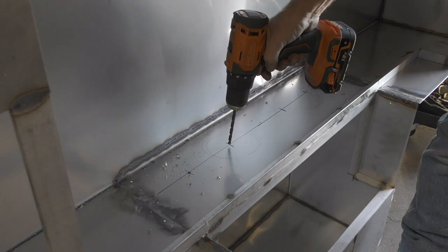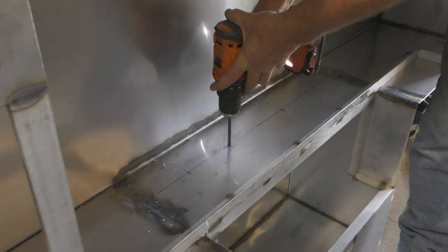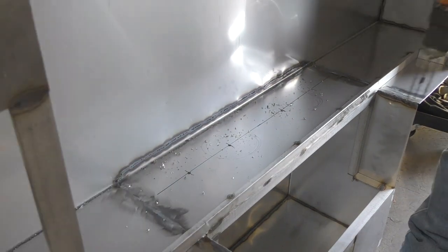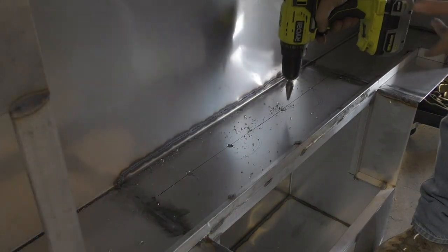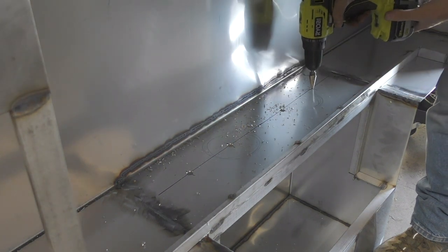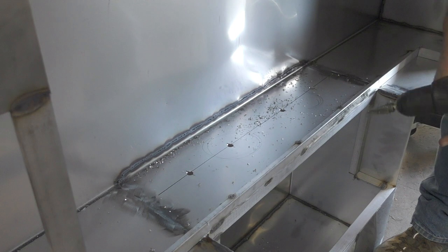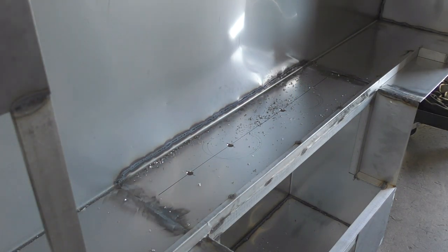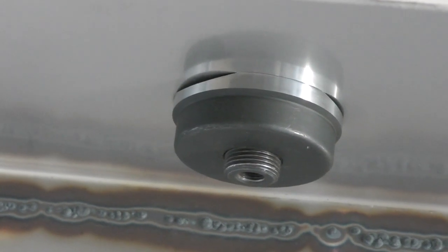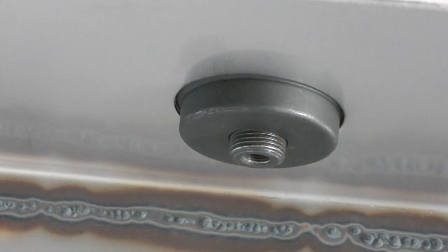Now this is where I'm going to start the process of punching holes. I need to drill some holes into the five foot section water basin to create pilot holes in order to get a punch in there to create the larger holes. Now drilling through stainless means you're going to go through a lot of bits. This is why we've started punching stainless, but we do still have to drill a pilot hole. The punch I use is very cool — I'll leave a link to another video that shows how this works. Basically drill a pilot hole, use a small die that creates about a one inch opening, then you can move to the larger holes. On this particular water feature I'm going to be punching two inch holes. Once you get set up to punch, you start to pump the handle and you can actually see the die pull through the stainless as it creates a perfect hole. This will allow the water to transfer between the main basin and the two side pieces I welded on.